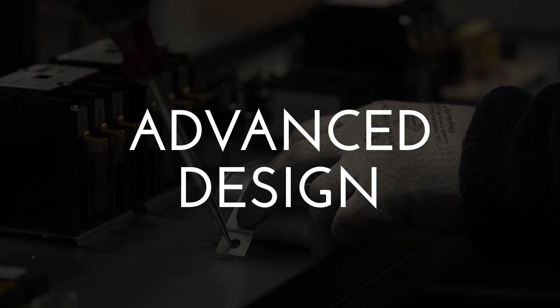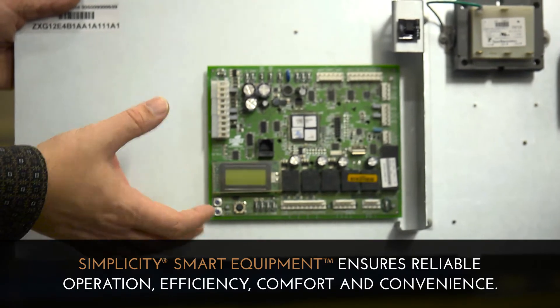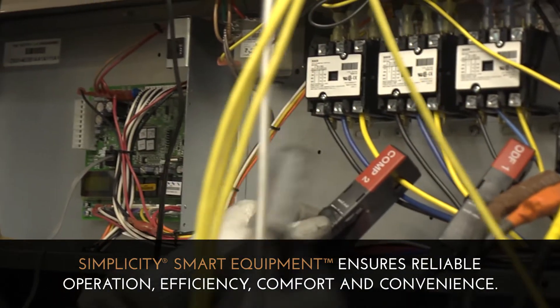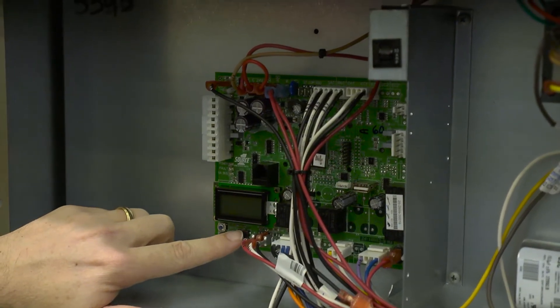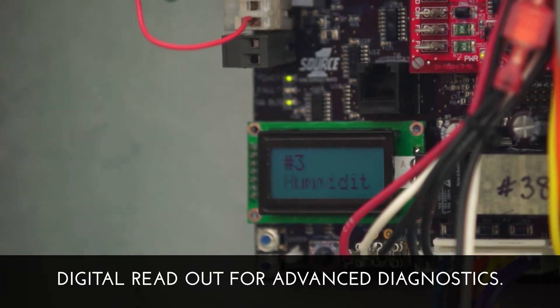This is the main control that we're calling our Simplicity Smart Equipment. It's the unit-based control that takes over management of all of the various components in the unit. The majority of the installations are done with just basic thermostats, and we made sure that there was a lot of access and availability to get to your thermostat connection. A lot of unit-based controls just simply have LED lights that flash to tell you what the control is doing — we moved away from the LEDs to actually having an LCD display.